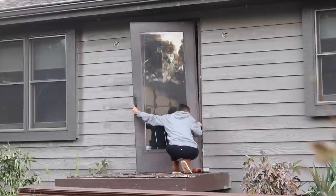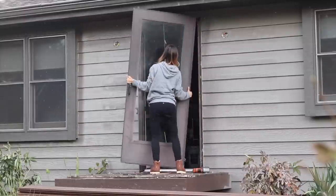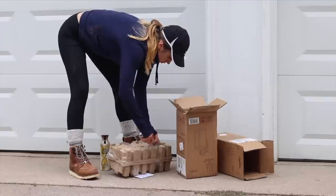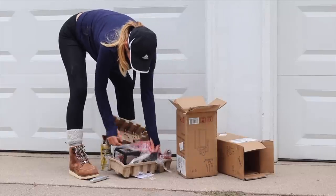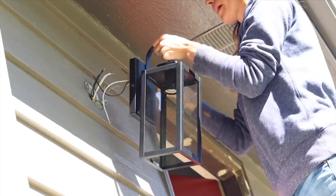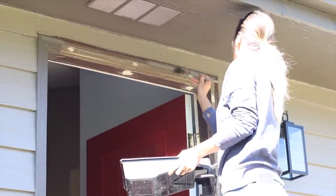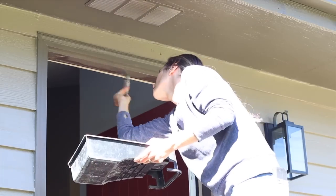You'll notice in this clip that now there are two junction boxes for light fixtures. That's because before I had the house painted, I called my electrician to run new wire through the soffit and actually split the light — there was only one light there, and we pulled another one to make the front entrance symmetrical and flank the door with two lights. The lights I got are a lantern style, done in a powder coated black finish. They came in a pack of four from Overstock, and those are also linked in the description. Installing the new lights was really easy, and once that was done, I was excited to get the brick mold and the trim around the door painted the same as the trim on the rest of the house — it's the color Peppery, and I love this gray up next to the Spiced Berry red.